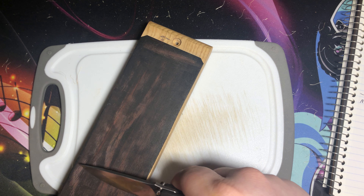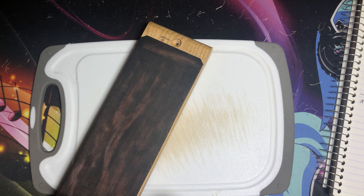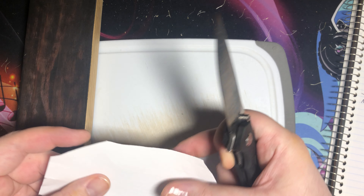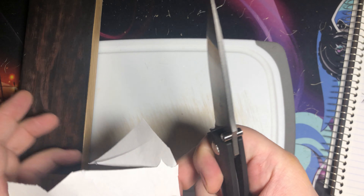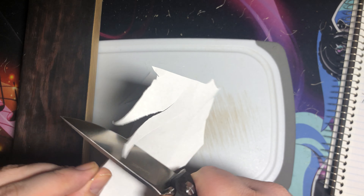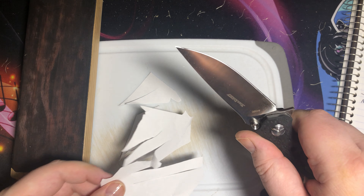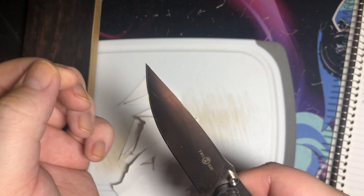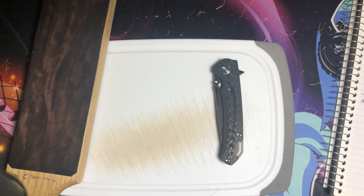I do have a little bit of burr on the other side. Alright, let's see what that buys me — it doesn't quite have the polished edge back. I'd probably need to grind it a bit, but you're certainly back to a decent working edge. I'd probably only put it back on the 12,000-grit belt and then strop it back up from there.